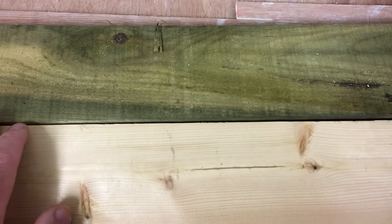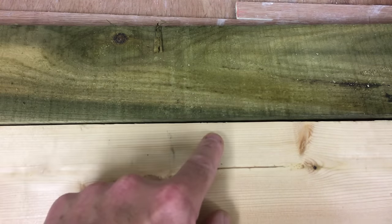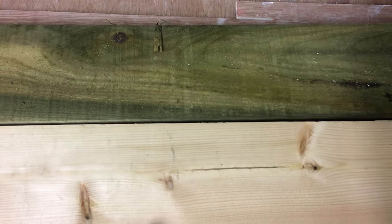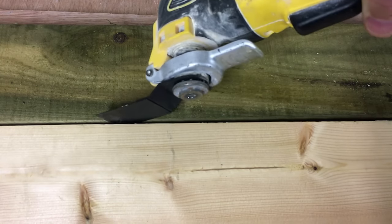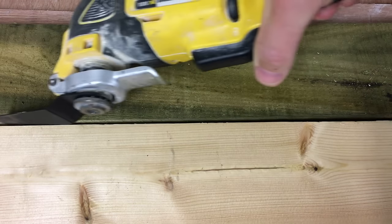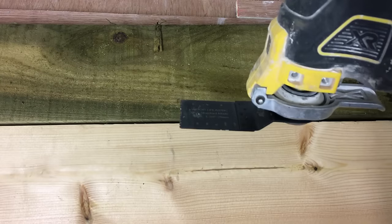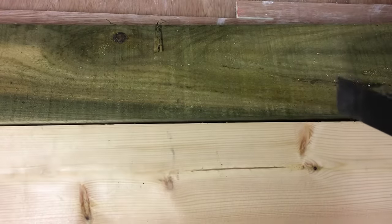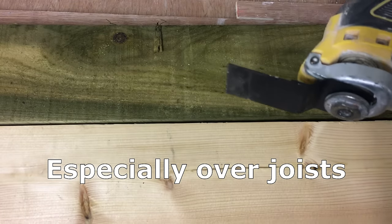Another use — bear with me with the demonstration. What I'm replicating here is tongue-and-groove floorboards. In order to get a section of flooring up, it's usually really difficult if there's a tongue and groove. What you do is use the multi-tool: slip it down into the joint, run along that joint, and cut the tongue off the flooring. A couple of runs along there and you can get a pry bar in to pry the flooring up. That's probably one of the most common uses for the multi-tool. In the same theme, whether it's floorboards or chipboard flooring, you can cut out hatches if you need to get under the floor — especially useful for electricians or plumbers. The multi-tool is excellent for that: just plunge cut and cut the area out quite easily.